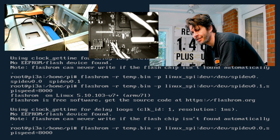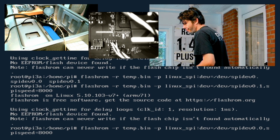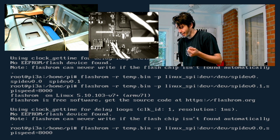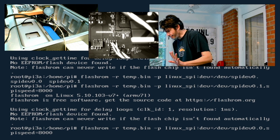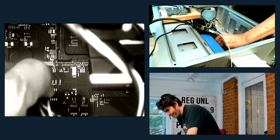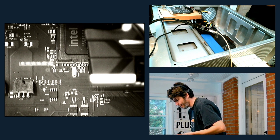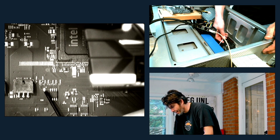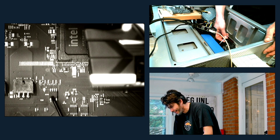Still nothing happens. And the SPI speed, 8 megs seems to be pretty safe. In some tests, I was able to read chips as high as like 32 megs. So anyway, I've tried a number of things to get in there. I've successfully read boards and chips in circuit before. So, this not working, most likely the board is somehow shutting out the bus to the chip.